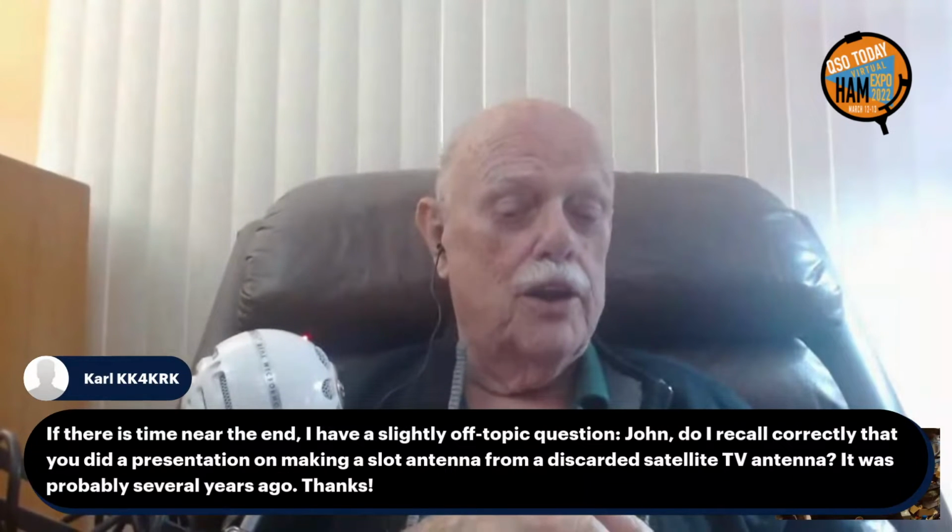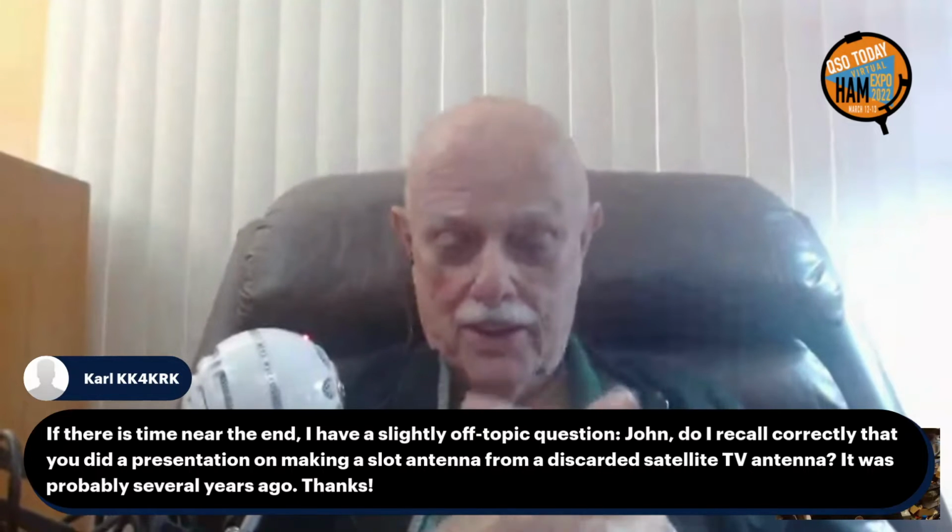So if you want to buy some aluminum pipe that fits the PVC pipe you buy for building sprinklers at your hardware store, go to the metals dealer and buy not half-inch tubing, buy half-inch schedule aluminum pipe. It fits exactly into the PVC pipe you buy at the hardware store. I've built all sorts of antennas out of it, and you can fit them together just like they belong to each other. Don't buy aluminum tubing to go into PVC pipe. Buy Schedule 40 aluminum pipe. Anyway, that's a hint.